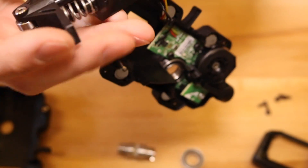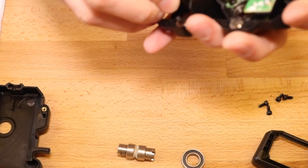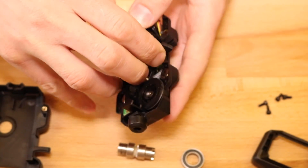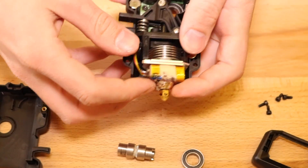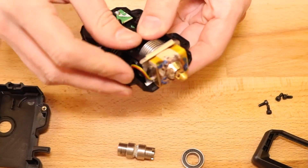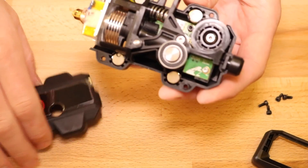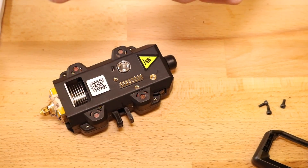Now to reassemble the Smart Extruder Plus, just reverse the steps that you took a moment ago and place everything back together. You can do this by pushing down on the lever and that'll help keep this in place inside the extruder body. I know it looks a little intimidating on the inside, but it's fairly simple once you're in there. Push the heating block inside and make sure the wires are tucked up into the body. Now take the castle nut, replace that, push that through, and place the bearing back on top. Now you're about halfway assembled — just place the body back on top.